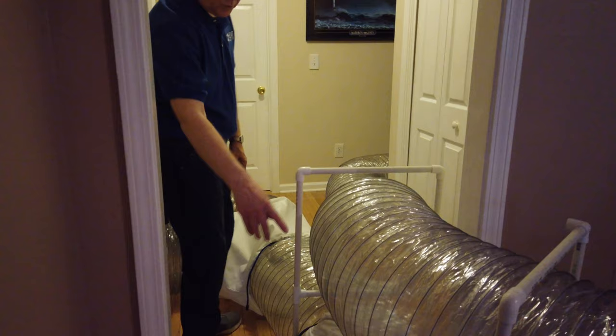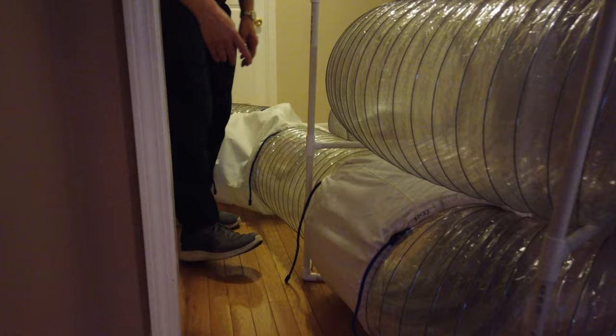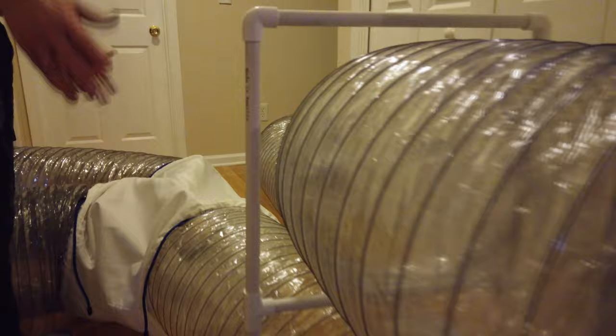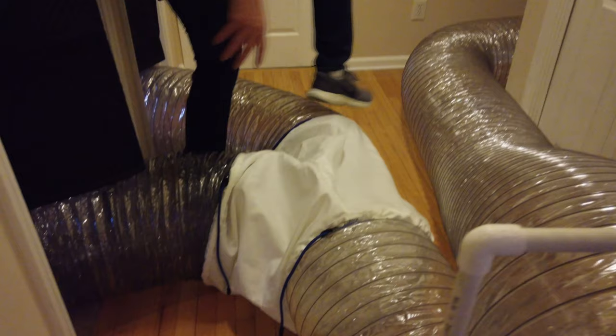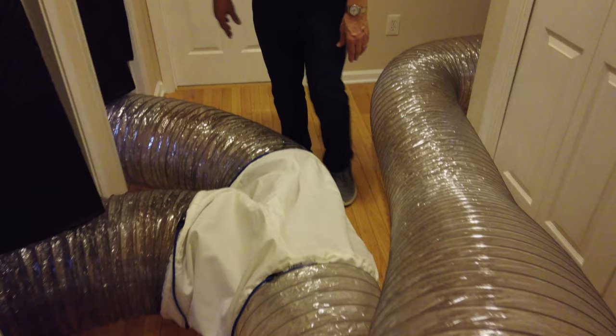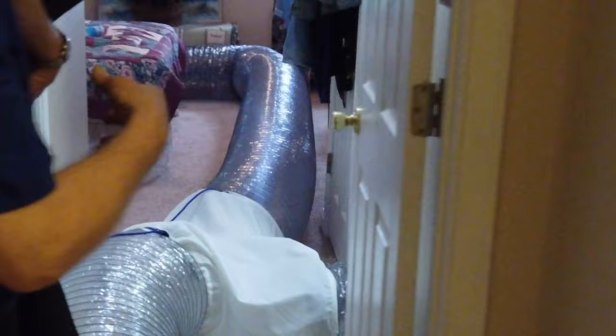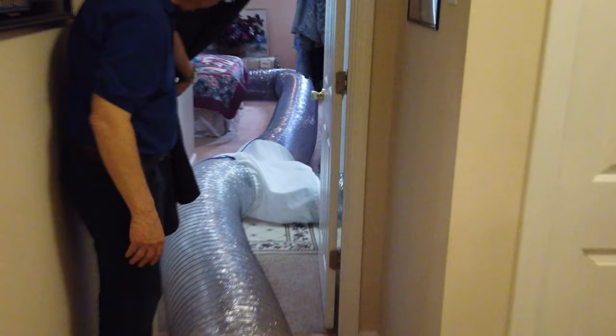Now on the second 25-foot length, we had to consolidate it into a very short length here using this piece to consolidate it in the middle, so the 25-foot length duct turns out to be only 10 feet — we don't have to cut them. Then we're going to have another Y that splits off into two 16-inch ducts for bedroom one and bedroom two. Bedroom three we run directly from the machine, then split with another Y for a large closet, and shoot the other one to the farthest point in the room.